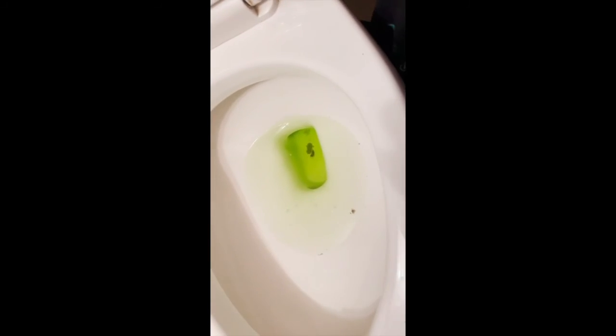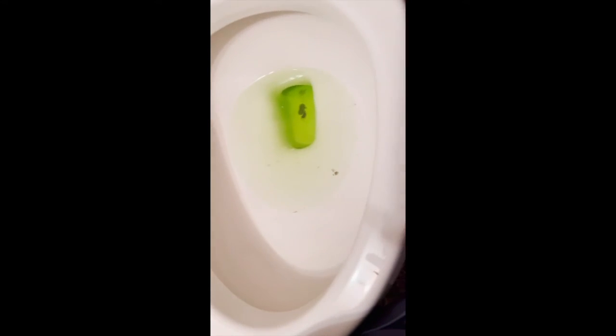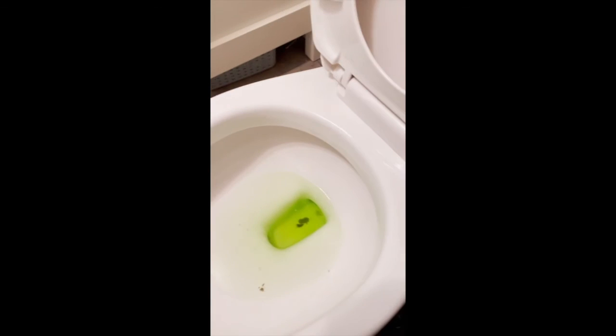I've let the CLR sit for another evening overnight. I can see there's still a bit of residual that has peeled off, not too much. This here was some of the scaling that came off just from the cleaning vinegar the very first night - you can see it's thin-walled, relatively thin. This is what came off initially before I started scraping in the inlet hole, and then the bigger chunks came out from there that had to be poked off the wall.